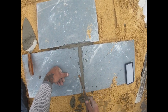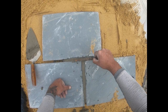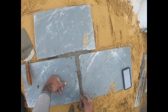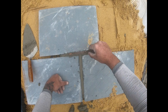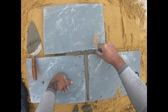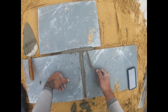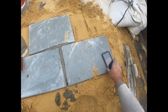So, anyways, now we're here. And we had let the cement tighten up a little bit. Every T section that you have, okay? You need to do this side first that butts into it, okay? And then you do the T. The reason why is that little mark right there. You'll see those marks all over your patio, all over your joint work. This looks more natural. Now I'm gonna wait for this to set up a little bit and I'll come hit it again and show you.